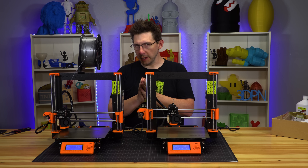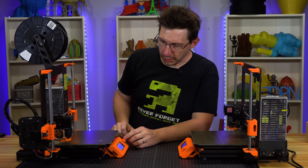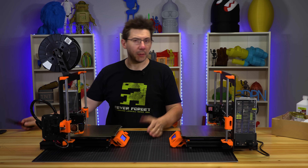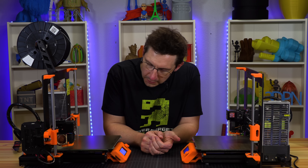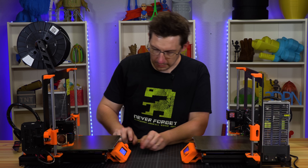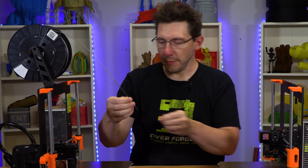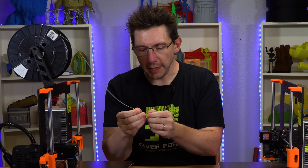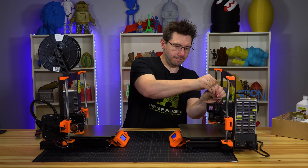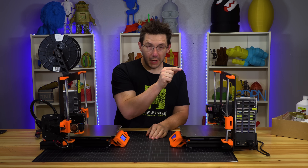It's been a little bit. Now that both Prusas have cooled down, let's preheat. I'm going to go down to preheat PLA on both. The MK3s warm up pretty quick — I believe it's because they're 24-volt systems. This one's at temperature, this one's close. I'm going to put this at unload, and this is at temperature — I'm going to put this at unload and hit the button at the same time. This one came out. This one does have a small ball at the end but it did come out. This one... that's not coming out. That's the problem. Let's dig in and I'll show you exactly what's going on.